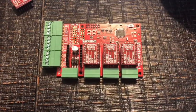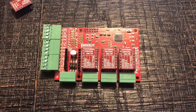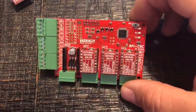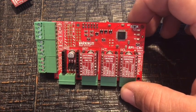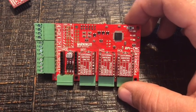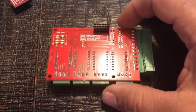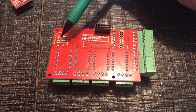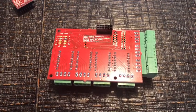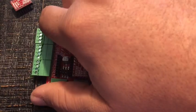You can do a whole lot with it and get it up and running very quickly. We're not dealing with the limit switches and all that yet — I just want to get the thing up and running. Something else to notice is that each one of these external driver cards is on its own axis, and they're labeled nicely X, Y, Z, and A. For this project I'm slaving the A and the Y together, and how you do that is on the back — all you have to do is put a little solder and jump the little sections right there and right there, and then you've slaved the A. You don't have to do it through hardware or software. It's a real nice little setup, very compact.